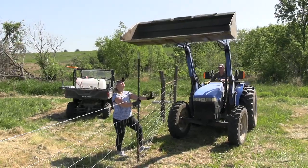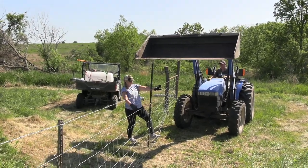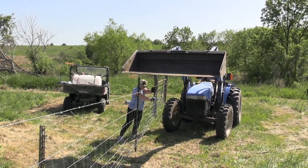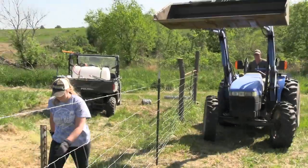The easiest way for me to put a T-post in is to just use the loader on my tractor. Lily was along and held the T-posts. After we had run that single strand of barbed wire and got it tight, we started putting T-posts in about every five yards along that barbed wire, and I just pushed them down with the bucket — especially if there's some moisture in the ground, they're pretty easy to put in. Then it's all about fastening that barbed wire at 53 to 54 inches and attaching your woven wire about four to five inches off the ground and you're done.